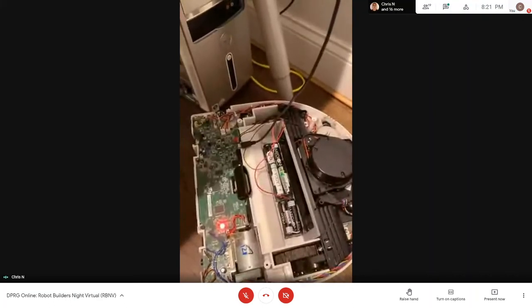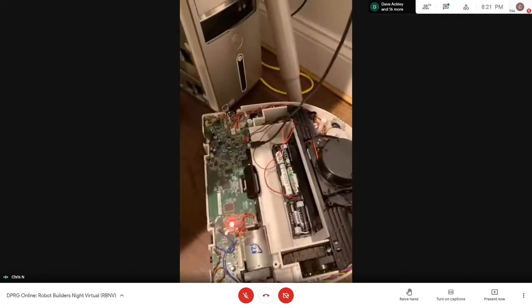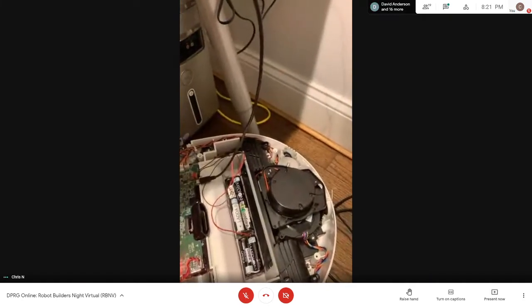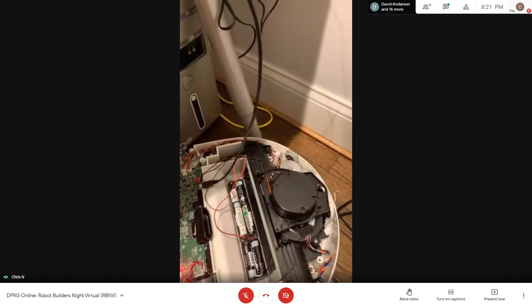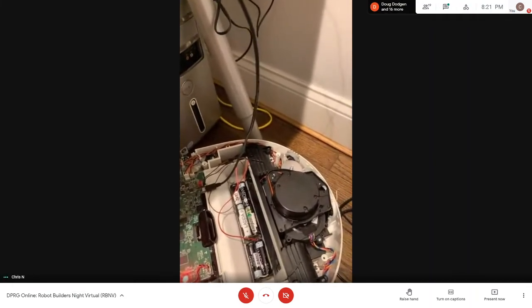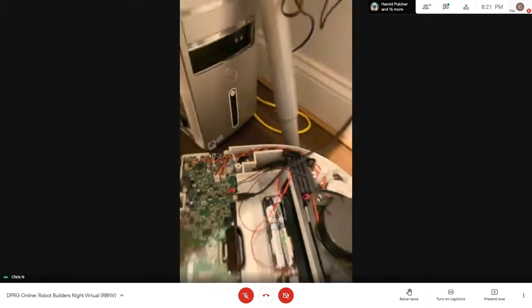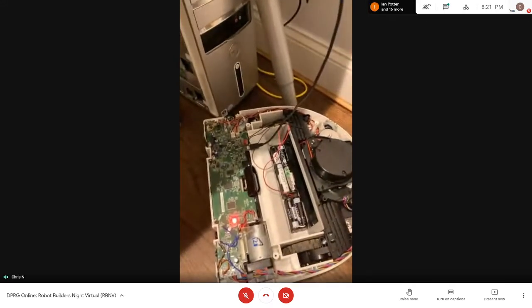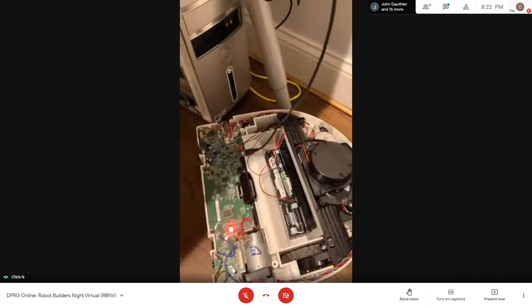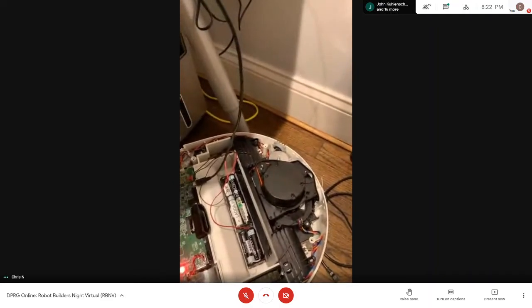The unfortunate thing, the main drawback I would say, is it's not really practical to get to the LiDAR data. I mean, there's a command to turn the LiDAR on, it starts spinning. You can ask it for the LiDAR data. It gives you all the readings, all 360 readings, one for every degree. But, as you can imagine, that serial port connection is quickly becoming a bottleneck, right? Every command takes a certain amount of time to execute. And if you ask for LiDAR data, that takes a fair amount of time. So it wouldn't really be practical to use that connection to get to the LiDAR data.